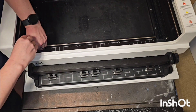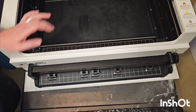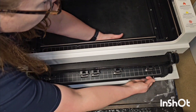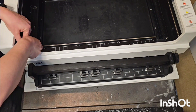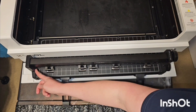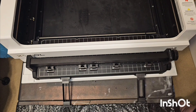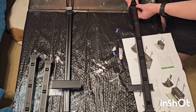I ran a test cut with a piece of cardboard so I could see how it's going to feed in and where it's going to start. I was cutting the letters for 'welcome' for a porch leaner, plus a little flower cutout — this was actually my first porch leaner, so it was a giant experiment. You can turn the xTool sideways, extend your table, and use the conveyor belt. You do need to be mindful that with the pass-through open you'll have more fumes, so you need adequate ventilation — at the time I tried this I was in a spare bedroom with the window open.